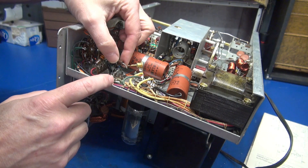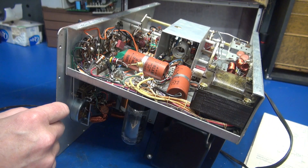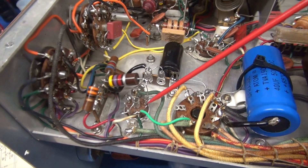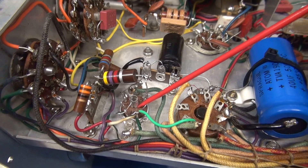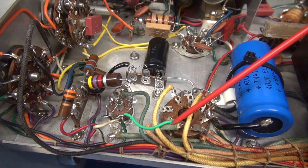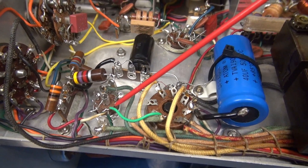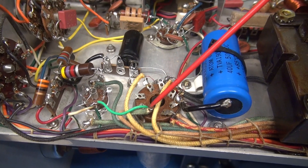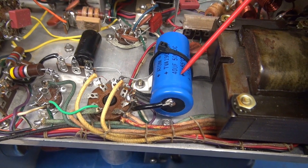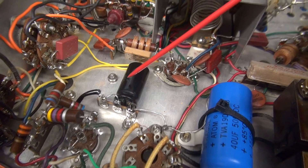I'm going to start off by removing the socket and rewiring it. There are some little orange wires tearing off across the chassis and there's another coil up here — I'm going to get it all out. Here's a close-up of the repaired area. I found an original Johnson-type Cinch socket for the 6X4, so that's replaced and all the wiring is back as it should be. You'll see this additional green wire supplying the filament to pin 3 of the 6X4. There were just too many wires to cram onto that one terminal, so I found an unused terminal on the 5U4 as a landing spot.